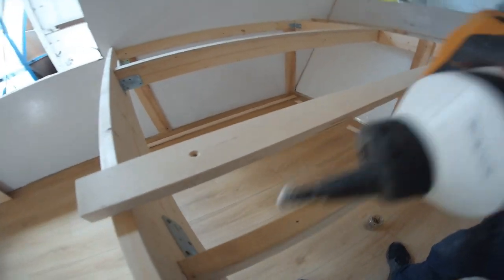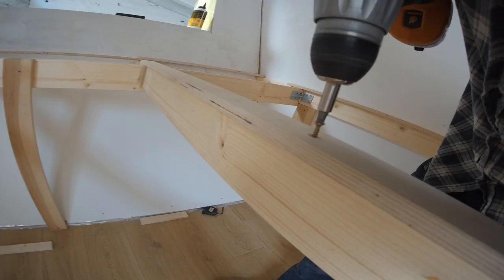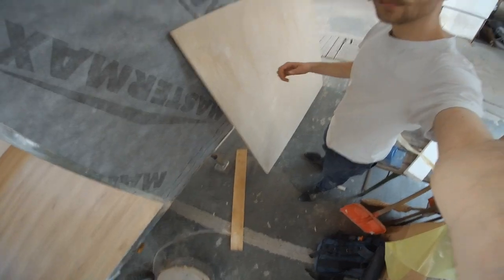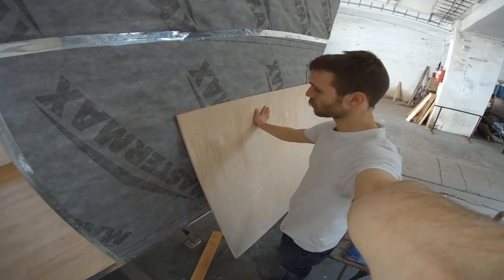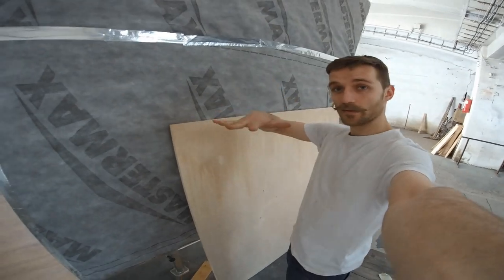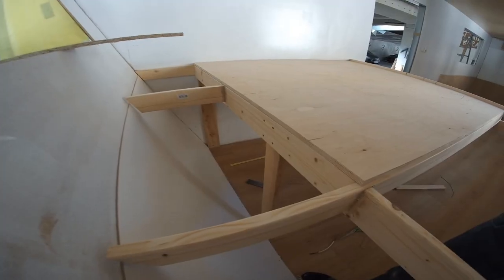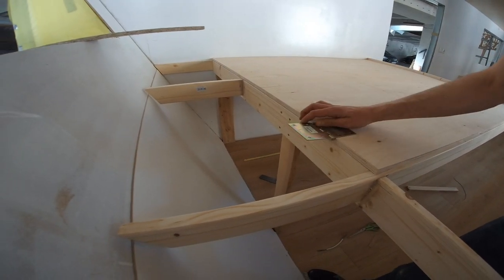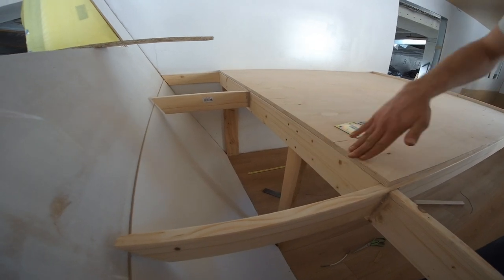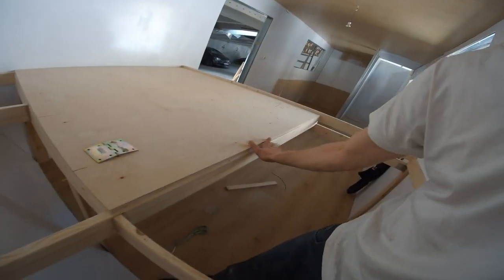Aside from pre-drilling the holes, I will also be gluing the planks into place. I ordered pretty big 1.5 meter by 1.5 meter plywood that is 15 millimeters thick, and I will use that to cover my bed. The right two panels will be openable for storage underneath, and on this side there will be the built-in table. On the back truss I will place a double-sided hinge so I can hinge each part and access both as storage. I just measure the distances and fill them up with plywood.